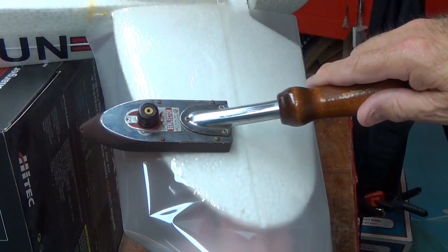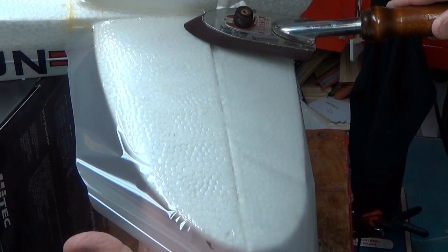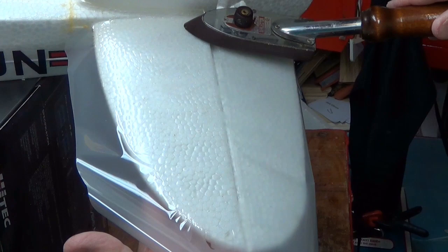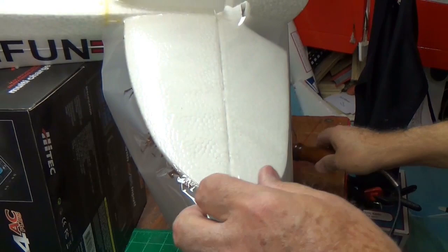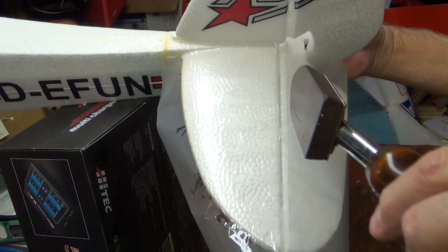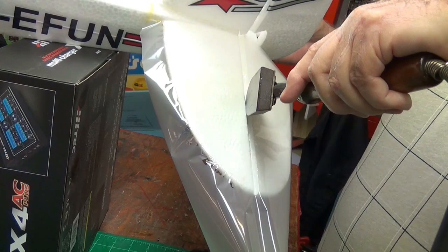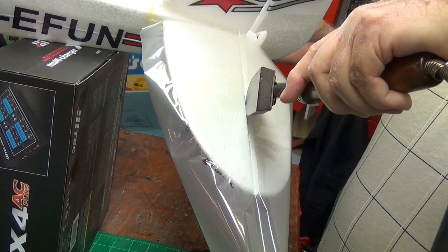Then work your way to this way. Now you can burn through this thin stuff — don't stop, keep it moving all the time. As long as you're moving all the time you can see it. We're going to go down over the edge like that. I'm going to take the edge of my iron and stick it down in here, because this is going to help be a hinge — this is actually going to make you a better hinge. You can actually make a hinge out of it.